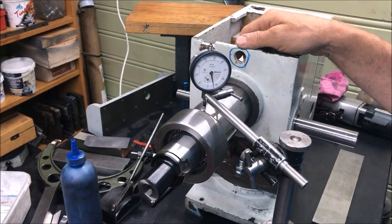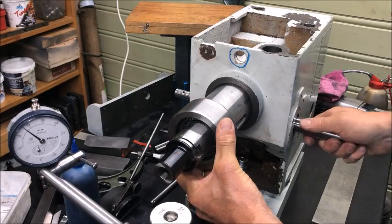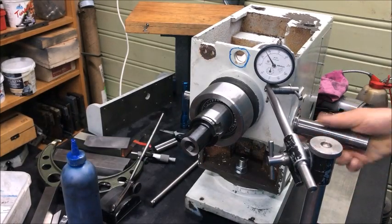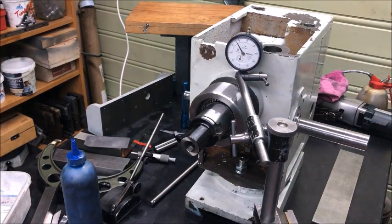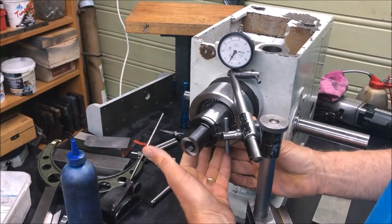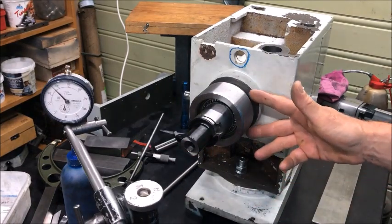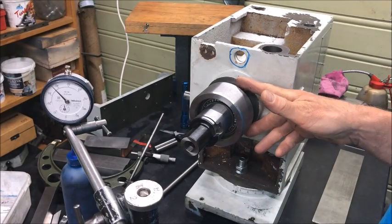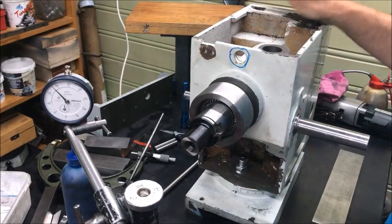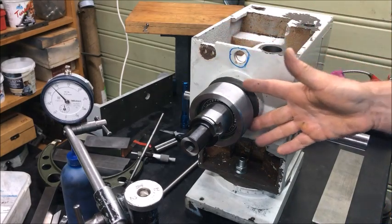It's not meant for that purpose either. You could argue that when you're milling, you should have the spindle probably in here. I'll just try to see if there is any slop at that point also — and you can see there is. You can argue you have to lock down the spindle, which is correct, but still you have that amount of play, because locking down wouldn't mean that on all the circumference you have complete fixing. Even so, you will have that uncertainty, I think.